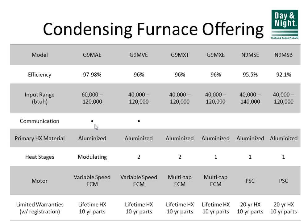The warranty on this furnace is a lifetime warranty on the heat exchanger for the original owner of the furnace. If you sell the house, it becomes a 20-year limited warranty, and then it's 10-year on parts — assuming that you or the homeowner fill out the registration paperwork, otherwise the warranties are shorter. The second column, the G9MVE, replaces the G9MVT with a difference to heat exchanger design. It is 96% AFUE in all sizes and all orientations — upflow, downflow, horizontal — and from 40,000 up to 120,000 BTUs.